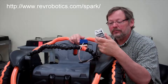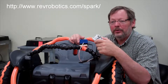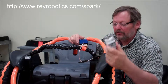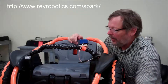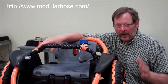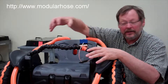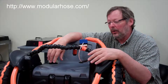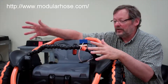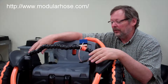These Spark controllers are really easy to interface. The computer just thinks it's a servo — you write different pulse widths to it and it's very, very simple. I'm also using Lockline, which is a wonderful piece of equipment that every shop should have. This allows me to easily snap the joystick out and snap it on the other side, so if I want to use it with somebody who can only use the right hand, I can change it on the fly.